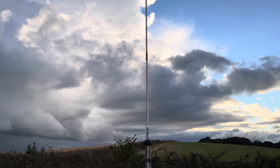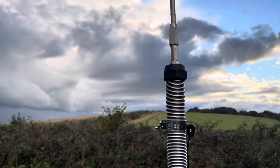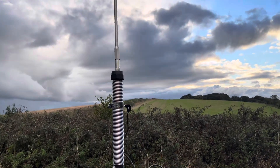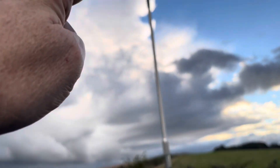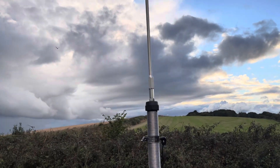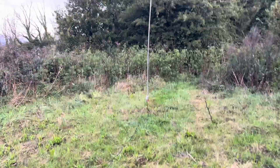The whip is literally about 93 centimetres. In conjunction with the length of the coil - probably about 10 inches - the whole thing is just over a metre long. When we look at the length of the coil from the point we've tuned it up to the top of the coil and then the antenna, the whole antenna including the length of the coil being used is about a metre long.